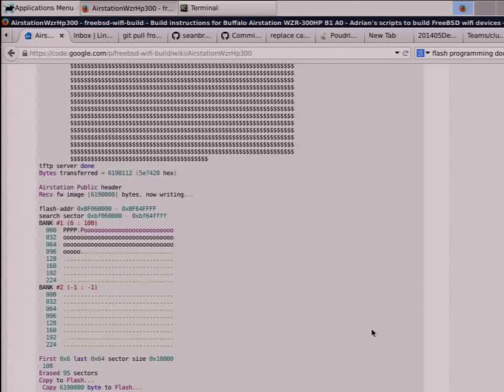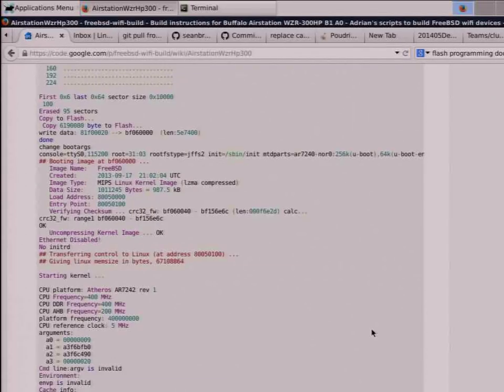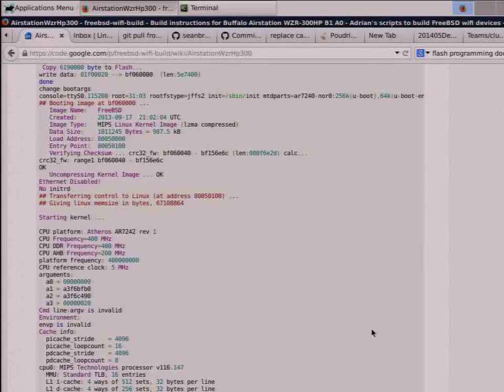The firmware files have signatures on them. Sometimes it's just a string. Sometimes it's padding. Sometimes it's whatever. When the system boots up, it'll tell you. U-boot will tell you what Linux is probably going to look for. So MTD parts is the term that's used to explain where the subdivisions of stuff are. U-boot only cares about where the kernel is.